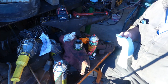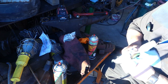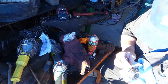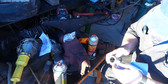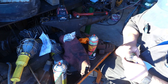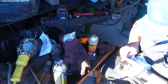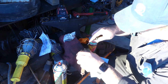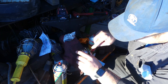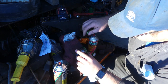and we're gonna clean up the head gland here, because there's definitely always some dirt, always some stuff on this. So make sure we get her good and clean. In here, there's part of the seal that's blue. I want to try to get that off, it might be grease actually from the installation of it. And sometimes you're better off just taking your pick and running down the edge like this, just to get her cleaned up a little bit, making sure that all that rust that's up in here is out of there. I'm gonna grab some Scotch-Brite though, I think, for that real quick.